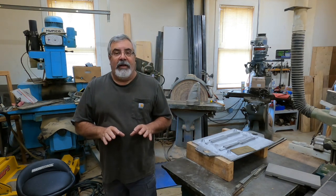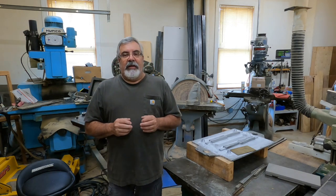What we're gonna be doing today is we have an aluminum match plate that actually belongs to the train club that I belong to, and we need to add some stock to it. So there's a couple of ways we could go about this. We only need a couple castings, probably put some Bondo on there, build it up a little bit, but I'm going to show you the old style traditional way. It's called shingling, okay? That's one of the things we did. So we'll get to that in a minute.